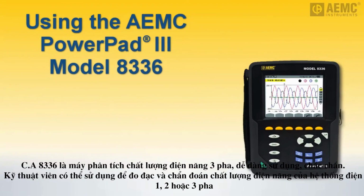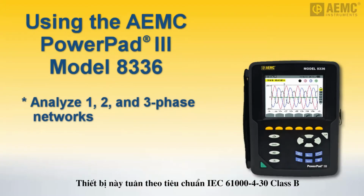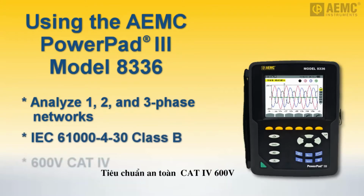The PowerPad 3 Model 8336 is a three-phase power quality analyzer that is easy to use, compact, and shock-resistant. It enables technicians and engineers to measure and carry out diagnostics and power quality work on 1, 2, or 3-phase networks. The instrument is IEC 61000-4-30 Class B compliant and safety rated to 600 volts Category 4.